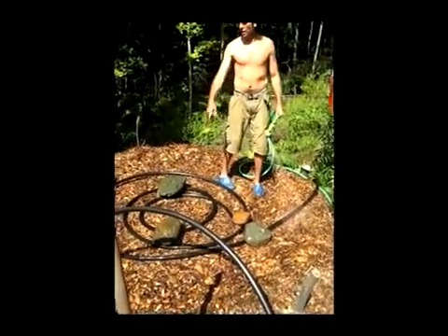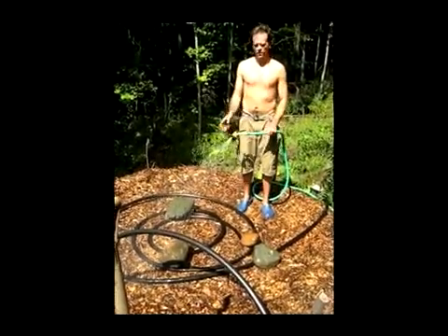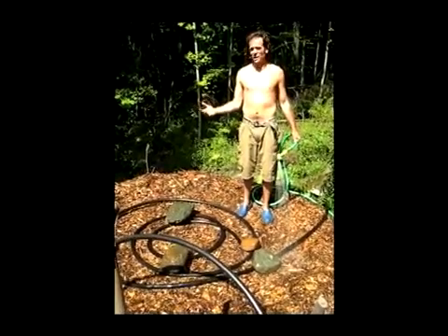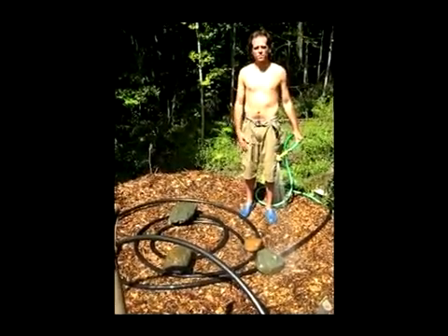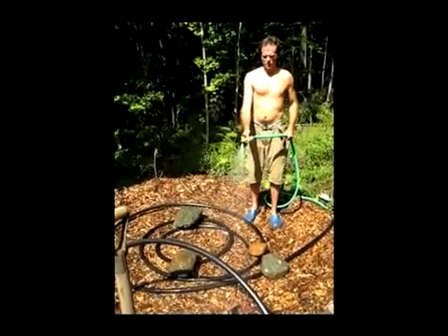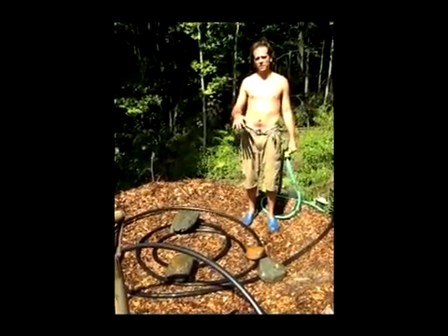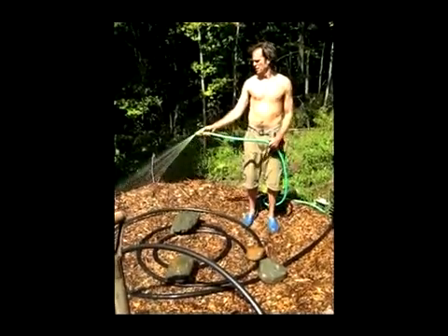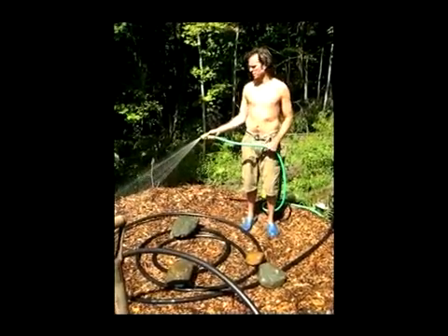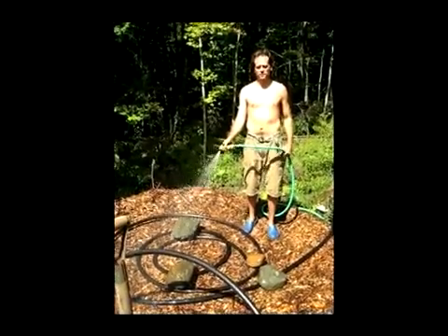There will be about 40 gallons of hot water in this total 400 feet of coil, so basically we'll be able to use 40 gallons of hot water at a time. It'll go to our hot water tank for the heat exchanger. I'm not sure how long it'll take to recover, but other videos we've seen said about 10 minutes. The question is what's the gallons per minute you can draw at a steady rate without the temperature dropping below 120. John Payne was getting a gallon a minute of 140-degree water for 18 straight months with his, but his was about twice the size — so that's one of the questions depending on how we put it together.